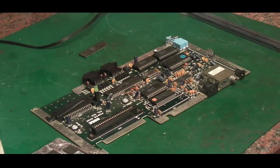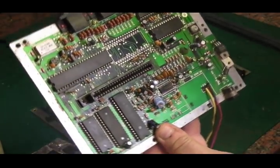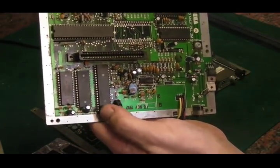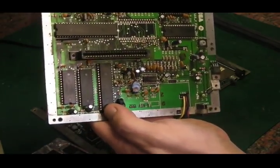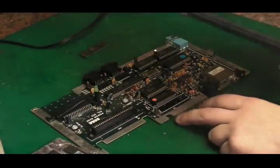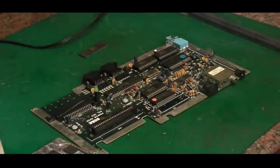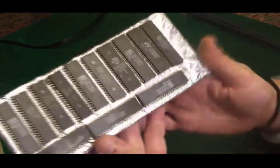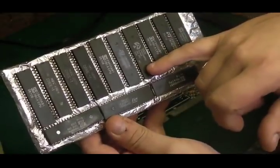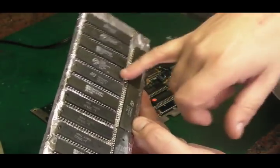Now, my initial thought was I was going to whip the Z80 off my little donor board here and try that on there, but it means desoldering a 40-pin package when I don't really need to, because we don't actually know whether this works, because this is a dead board. Well, obviously we've proved that the VDP off it worked, because that's what we've got running on this board now, but for the rest of this, like I said, it could have a fault on it. It could be the Z80 that's dead on this. So rather than that, I went through my stock of Z80 processors, and I actually do have an exact replacement for that there. It's the Zilog one, and it's exactly the same part number as what came off here. So that's what I'm going to fit.